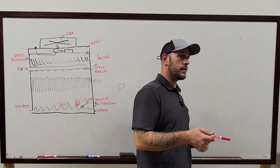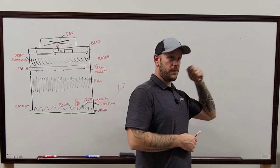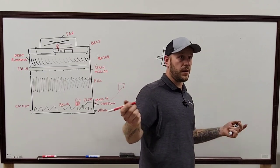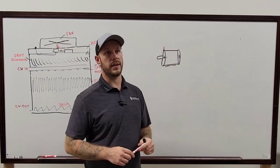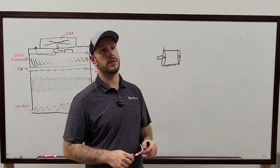On your condenser water, your isolation valve that's normally right before the tower, if that is closed, there's no water that's gonna be punching back out there through that pump. Obviously, don't leave it running that way. Then the water's just gonna deadhead and you're gonna overheat that pump. But that's an easy way for you to test it to see if that valve is closed.